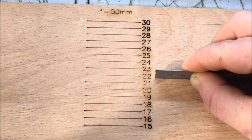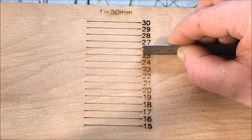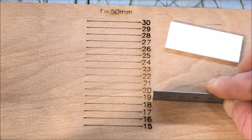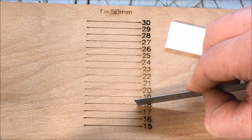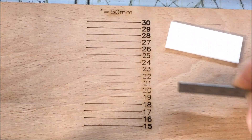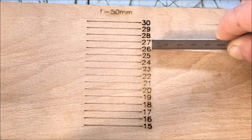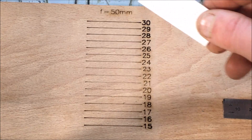When I want to do a deep cut I want to use the full range of the high density power. I would set my device to line up at say 18-19mm thick — that way I'm starting my cut from there and I've got all the way down to about 25-26mm for cutting to take place. If I just start my deep cut at the focal point I can really only go down to a depth of maybe 26-27mm before I lose power. That's why you need two different setters: one for deep cuts and one for surface work.